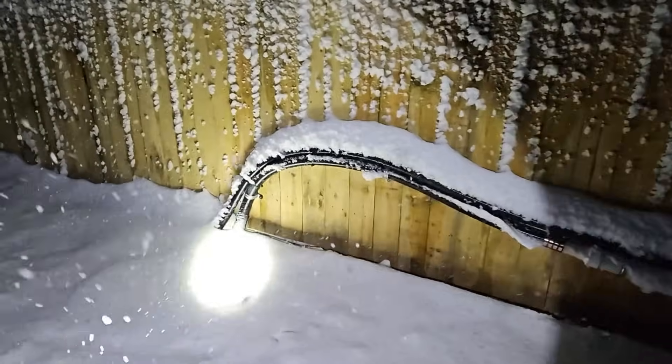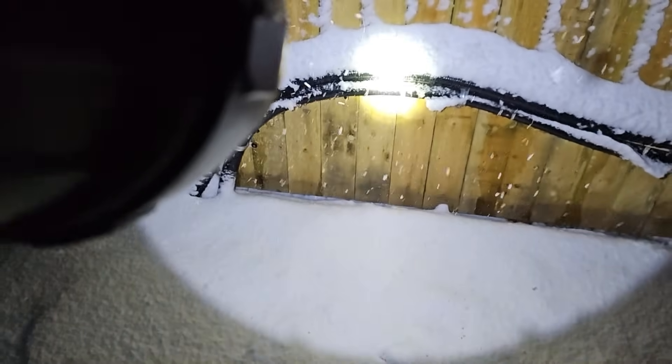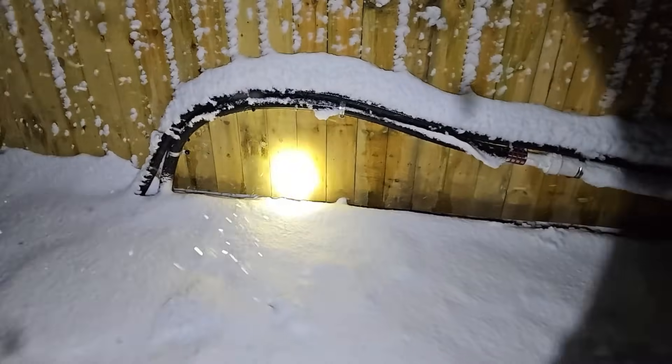That's a cycle. We don't have a check valve in here, so we're fine. If we had a check valve inside the plumbing, inside the sump pit, the water would be up in this line to about here — all this would freeze. When it shut off, the three-inch pipe right here broke the siphon, so it would have pulled some of the water back in. We got a really big sump, extra chamber — not worried about it. This is emptied. It's on a hard angle. We didn't bury it under the ground because it would freeze.